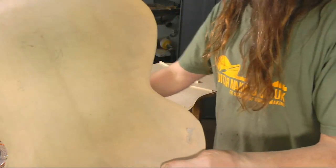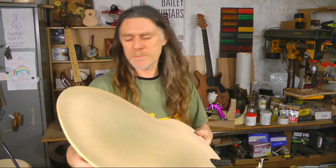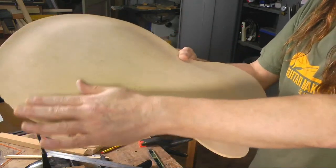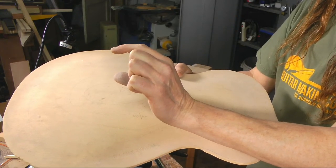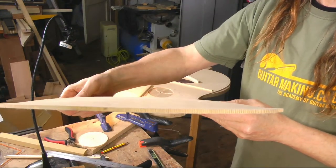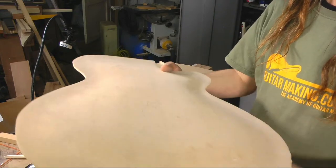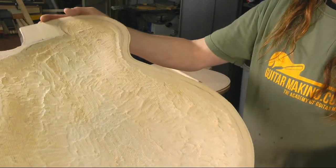Sometimes I build guitars on spec, hoping that someone will buy one, but I can't do that very often because it costs so much money to make a guitar and it takes so much time. This is one that I started in the hope that someone will come in and put some money down on it. But you can see the difference is the strength of an archtop comes built into the wood. So this started life as an 1¼-inch thick piece of spruce. It only really needs to be that thick in the middle, so it always comes wedge-shaped. It doesn't need to be that thick at the edges. So you get two wedges, glue them together, and then cut your shape out and carve the outside shape first, and then we carve the inside shape. As you can see, this one's still in progress.